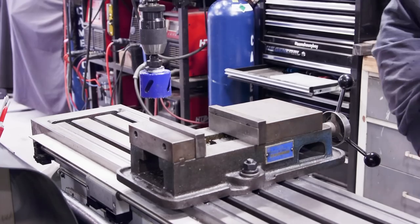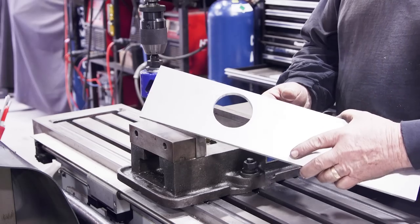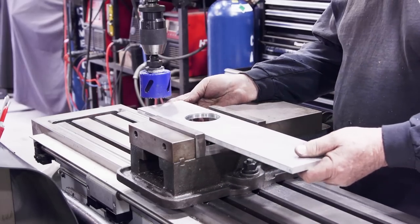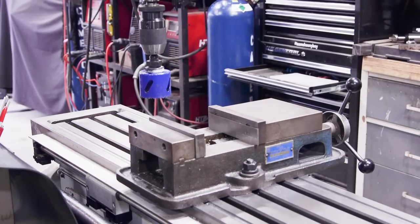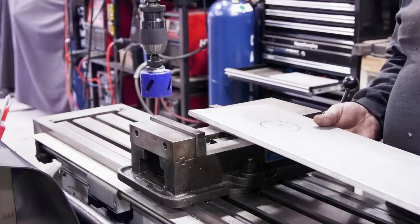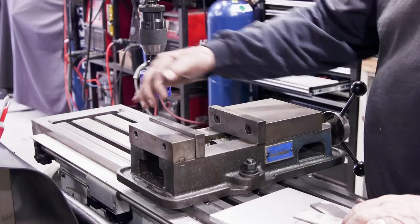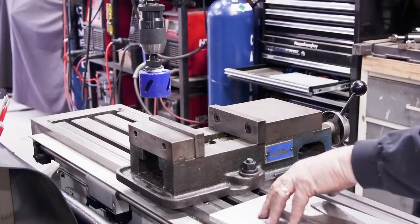One of the first operations is drilling a 2.5-inch hole through this plate using a 2.5-inch hole saw set up in the mill. That worked out pretty good — this plate is only 4 inches wide so it fit in the vise no problem. However, the next one is 7 inches wide and I've only got a 6-inch vise, so I'm going to take the jaw off and move it to the outside to give me enough space to clamp it down.